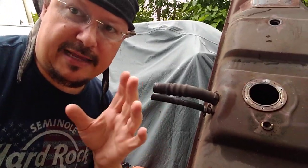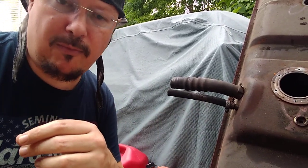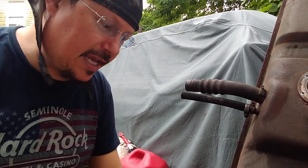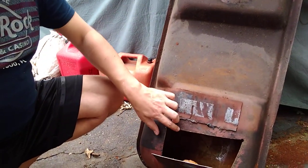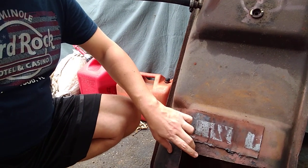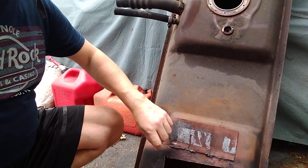Now, I saw a guy, an Asian guy, he has some kind of a channel where he builds boats out of foam. It's really cool actually to watch. But how he does a lot of the fittings on the boats, like the throttle and the shifters and the motor mounts, he welds a lot of stuff, and he does the MIG. And what he did is, he moves it over just a hair. He doesn't do it continually. He lets it cool just a little bit.